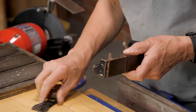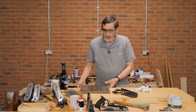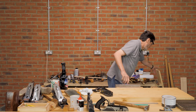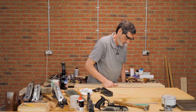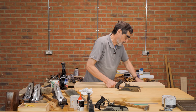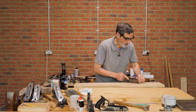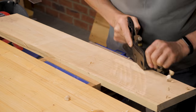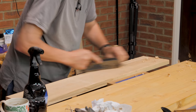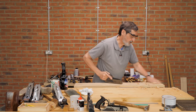I love this. I did this with a plane some time back and found it was the best scrub plane I'd ever used. This really is very reminiscent of the original Stanley scrub plane from nearly a century ago. Let's see how this works — I've got a piece of rough-sawn ash here. I've got the blade in, protruding slightly in the middle. Never tried it before with this particular plane. You go diagonally first to take off rough stock, and then you work along the grain like this.